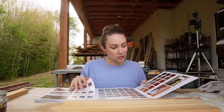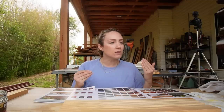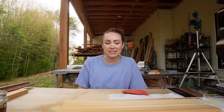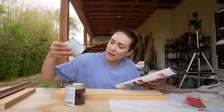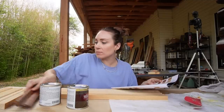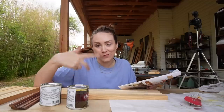I'm still getting adjusted back to Texas. Romeo and I have been doing a lot of two-person jobs that I haven't been filming for a big video. The two stain colors are cappuccino and russet. This swatch is one layer of cappuccino and two layers of russet — building up layers. That's what we're going to have to do on all the wood, because adding more pigment to a semi-transparent makes it more like paint and you lose the wood grain, which I don't want.